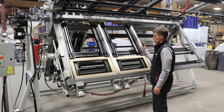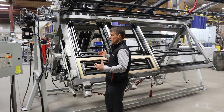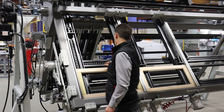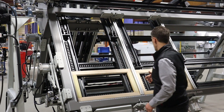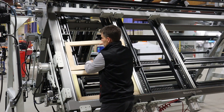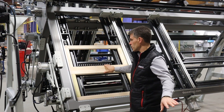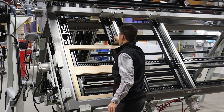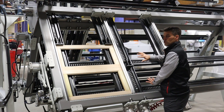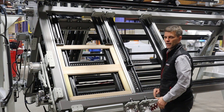Now the first door pushes on the second one. When we have larger clamps like this, it happens that customers want to increase production volume. What they do sometimes is make up to four doors at a time in the same section. If the doors are the same height — like here, probably two doors coming from the bottom of your kitchen cabinets — they can do two doors here and another two doors there, giving them four doors per section, as long as they are the same length.